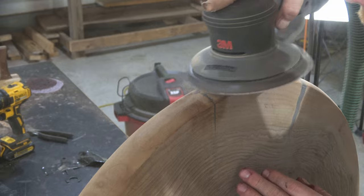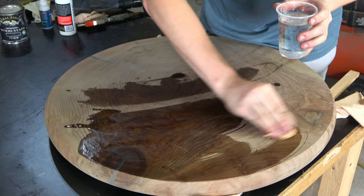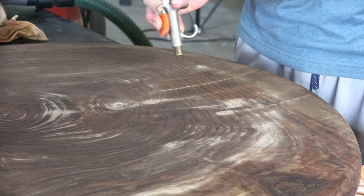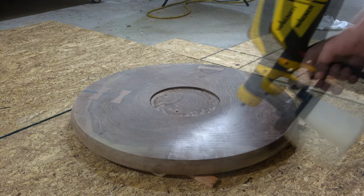There were a couple of touch-ups I had to make on the edge, but after that I could get ready to finally sand this table down. I water-popped between every grit and sanded from 80 grit all the way up to 220. A cool tip I learned: when waiting for the water to dry, just take some compressed air and blow it off — it dries in a fraction of the time and it's honestly pretty satisfying watching the water evaporate. Something that doesn't get talked about enough in finishing is using the right finish — it seems like a lot of people these days just use Rubio Monocoat because it's easy to apply.